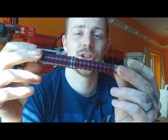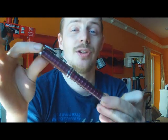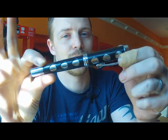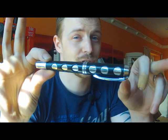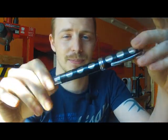And to give you an idea, here's a purple one. As you can see, that's been anodised and sealed, and it's got a nice lovely purple to it, and that looks just as nice as it did when I first made this pen. There's a black one, and I've cheated a little bit here, because through the middle of the pen I've chrome-plated the brass tubes, so once I've drilled through it, obviously you can then see the brass tubes which are now chrome, so it's a nice black pen with chrome circles on it.